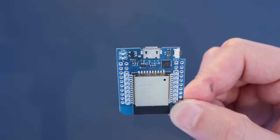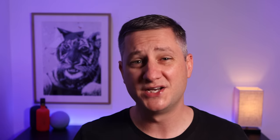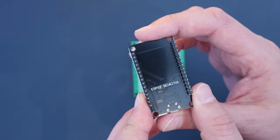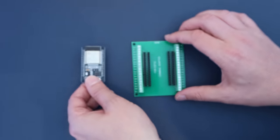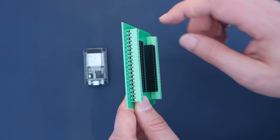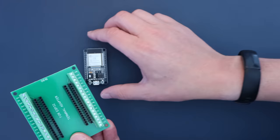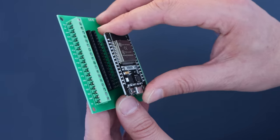The theory is basically the same — we wire up the pressure mat into some input-output pins on an ESP microcomputer and have it tell Home Assistant if the mat is pressed down or not. I know a lot of people don't really like soldering, so I found some ESP32 devices on Amazon that already have the pins soldered onto them. And then I found a prototyping board that you can just plug this device into that lets you screw the wires into a terminal block. The screw terminals on the side align to the pins, and you can see how they line up by looking at the back of the board.